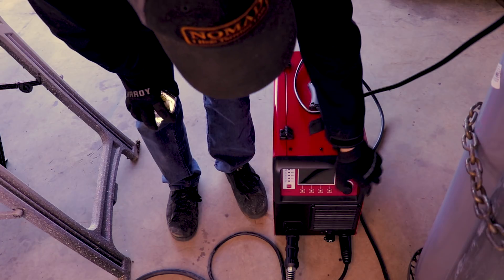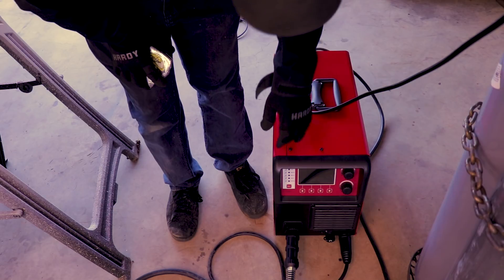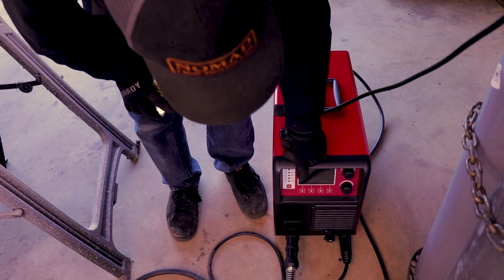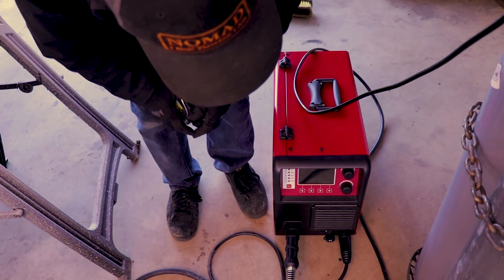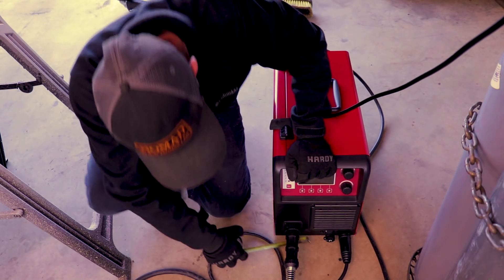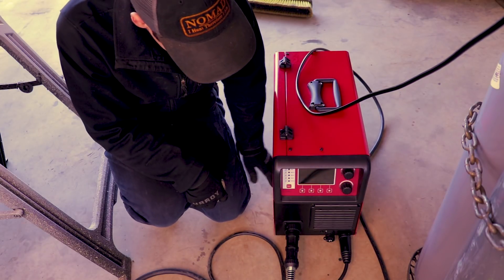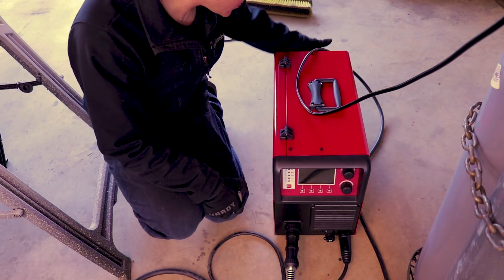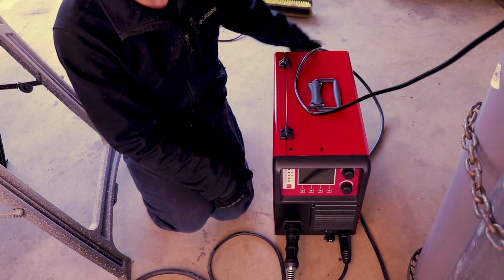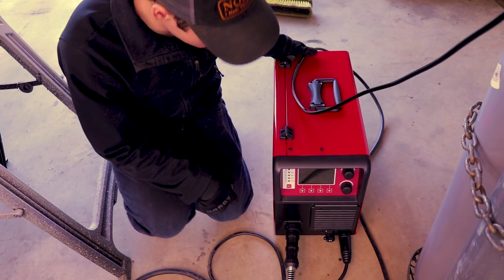This welder is 10 by 19 inches, but you've got to remember about your cables, your gas hose, and all that. On the front, if you're going to be putting a lip around to secure it, make sure it doesn't go any higher than the lowest part here, and that it doesn't block your door from hinging. In the back you want to add probably 5 inches so your cables don't get pinched from being too close.